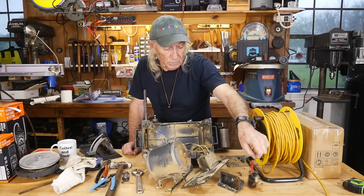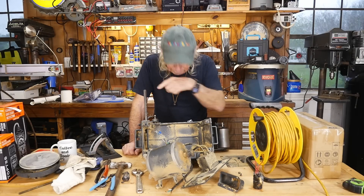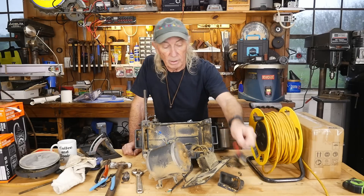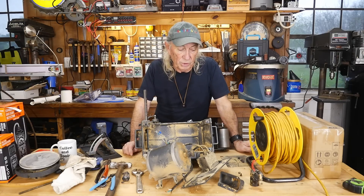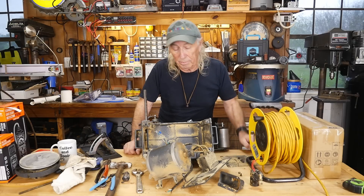When all the electrolyte and garbage in them has basically just about exploded, the start capacitor is gone. A lot of times if you can find a slightly stronger capacitor to replace it with, that can even help prevent this from happening again with your motor. I'm not even sure what caused that because capacitors should have a very long life. It does happen though.